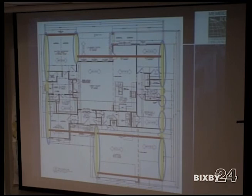The 24 inches for your special corner framing is here and here, because those are the ends of your braced wall lines. And the wall between those two windows you cannot count because it is less than. The one between these two windows, you really can't count this one because when you're looking at your elevations, there's a plate change here. It goes from 8 foot here to 10 foot here. So that space in between there, instead of having 42 inches in between there, I think that was like 42 inches, now it's broken down into 12 inches and 3 feet, whatever it was, because you have a plate height here and a plate height here. So you can't count that all as one there.